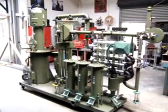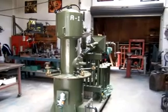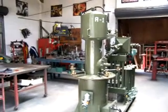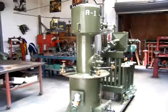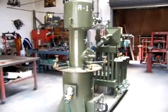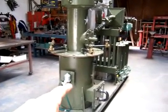Coming up this side here, this is the reactor part. As you can see she's quite tall. The top was an old upright dental compressor with a flip-top airtight lid, and below that is a three-piece tube I had to fabricate out of two pipes because I couldn't get the right diameter for the reducer, which is welded beneath it to go into the stainless steel cone — about 10mm thick inside. There is a wiper motor from a Nissan on the side, and you can see the heat shield I've also fabricated.